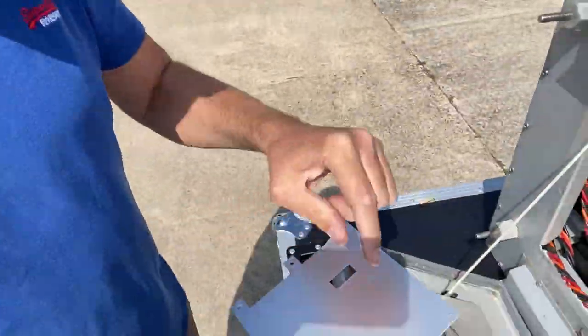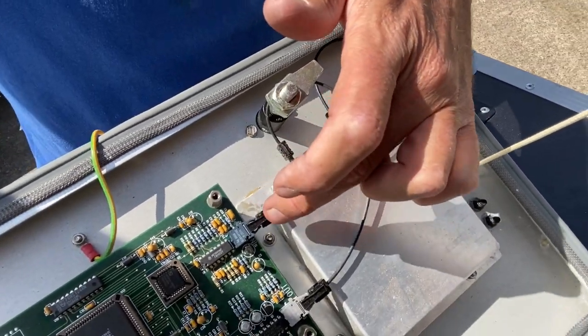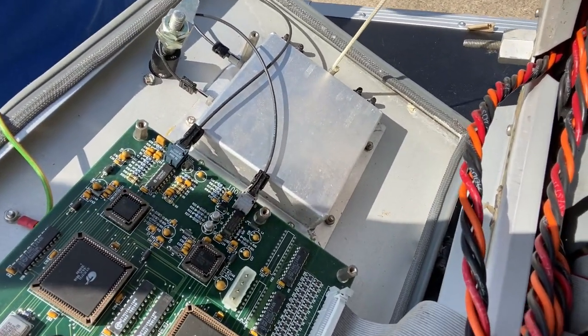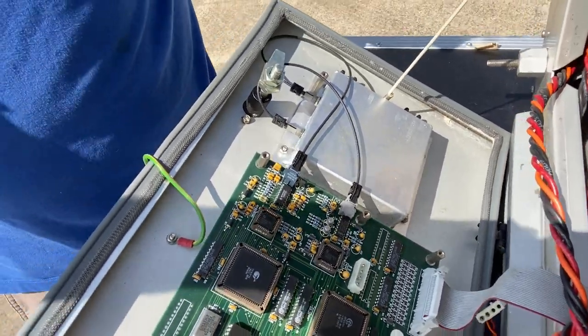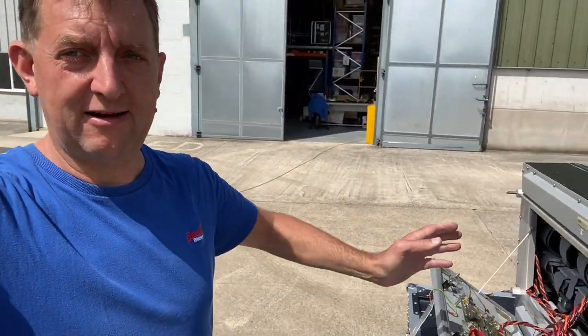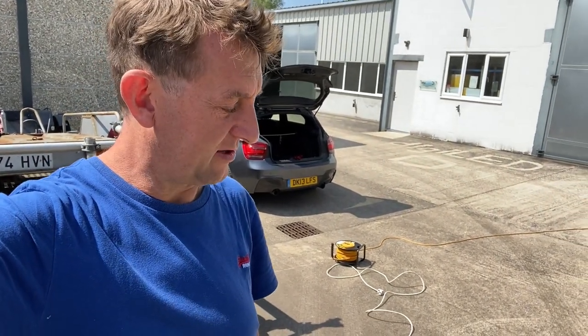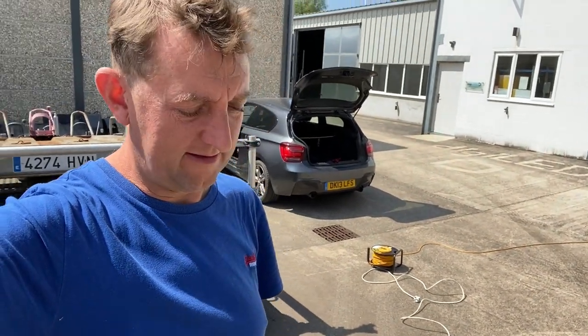But the taxi chips, yes, the taxi chips here. These little square plug-in chips. They were the chips that enabled the data to be transmitted over the fibre optics. They were the gateway to the use of the plastic fibre optic. And the manufacturer of the taxi chips packed up in around about millennium, 2001, and the availability of taxi chips stopped. So all of this processing technology that was based on a plastic fibre optic transmission system, suddenly there could no longer be any more manufactured. It was the end of the road for this technology.